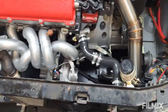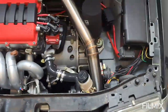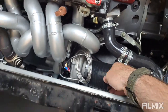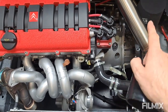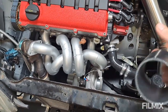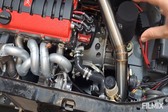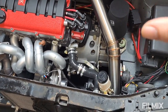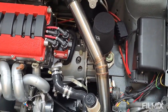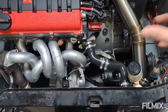It's got to come from there, sneak up, bring it up a little bit underneath this pipe and over there somewhere. I've bought a couple of bits — first, a little straight section so I can put a joiner on, because I bought a three-inch piece to go on there, and then a little 45 to come up. I'll make the piece with the 45 on first and then see how many bends I need. I've bought some straight three-inch and some pie cuts to give it a couple of tweaks.